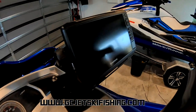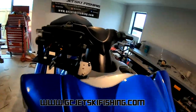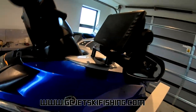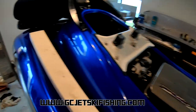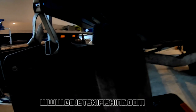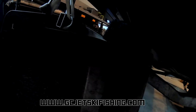Okay guys, we're getting back on with the install today — we've got a bit more daylight now. Here's the Garmin 7-inch mounted up there on the dash, all good to go. The power is all plugged in. I've got the transducer wire running down the left side of the hull and the power wire running down the right side of the hull, and that's all wired up to the battery nicely.